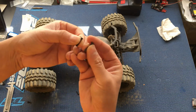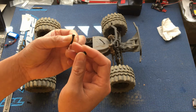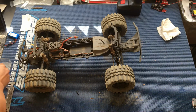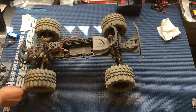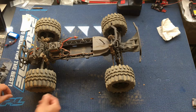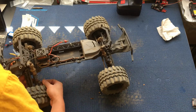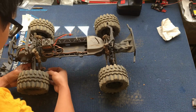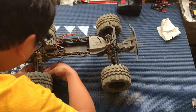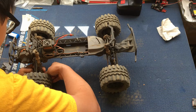You can see that it comes with these coarse threaded screws versus the fine threaded screws, which usually hold into plastic a little bit better and don't strip as much. So actually we'll go ahead and stick with these Phillips heads here just to have a little bit of consistency. And we're going to change the other side while we're at it to these longer screws. Just as a preventative measure, we had one side blow out. We'd probably have the other side tear that screw out as well.